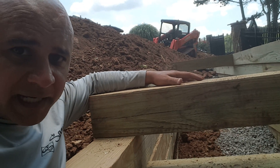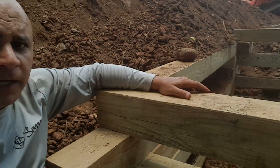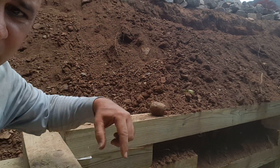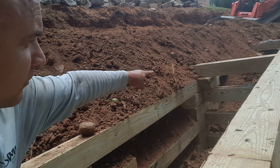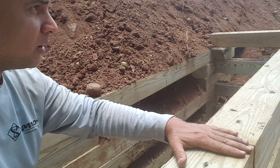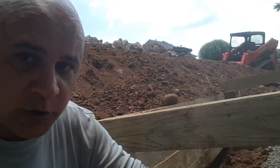I want to show you what we've done — I can tell you that this wall will never fail, and here's why. The way we're bracing this wall, our T-pieces that go across are actually interlocking with the next row of reinforcement down. So every eight feet we basically have another wall built behind this front facing wall, and that adds a ton of strength and structural support.